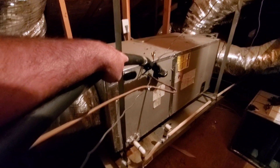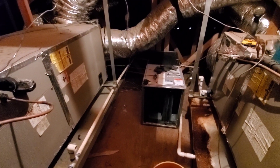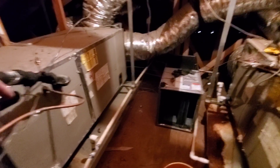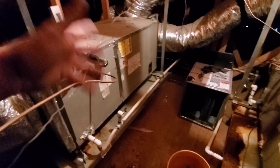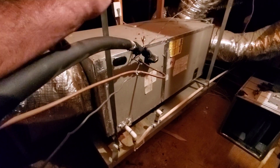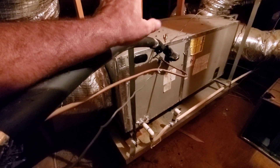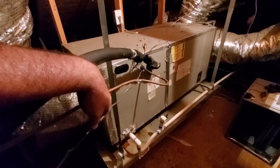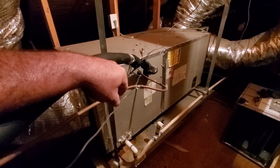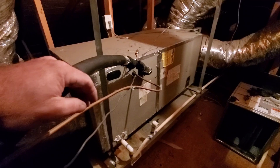For the upstairs, we're taking out a four-ton Goodman unit and putting in a three-ton R410 system — that is smaller. There are three reasons I went ahead and did that. One, I don't have to desecrate as much. Second, the three-ton unit will be able to tap off the resources of my solar better than a larger unit. Third, if the three-ton can't maintain set point — and it does maintain set point, that's fine — but if it doesn't keep up going from a four-ton R22 to a three-ton R410, that's definitely a drop in capacity. The bedroom I use for projects — I'll just shut that vent off and get an inexpensive mini split with its own solar panel array. That's just another project down the line. So yeah, getting ready to start tearing this apart.